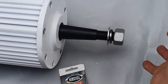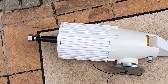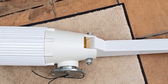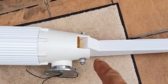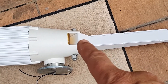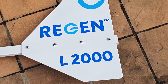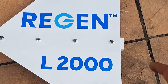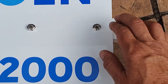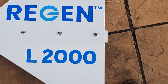Copper slip on here, and then put your hub on. I've just moved this over so I can put the blades together. This shows again which side the pole would be orientated on — in this case it would be at the back. This little elbow shoulder piece must be on this side, furthest away from the pole. Then the tail piece is on this side of the shaft, not the other side. It's designed to be on this side.